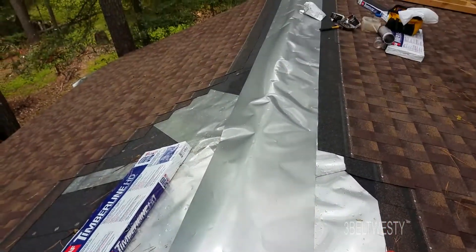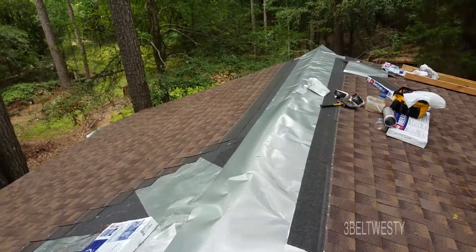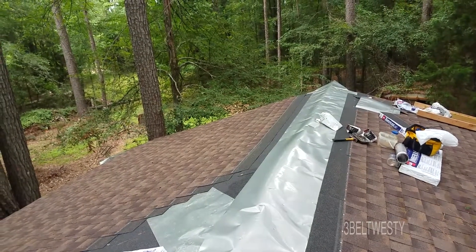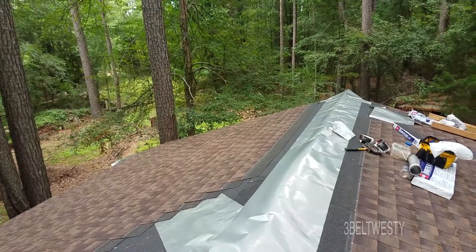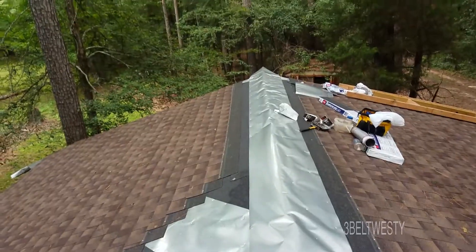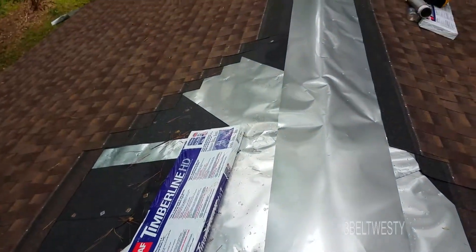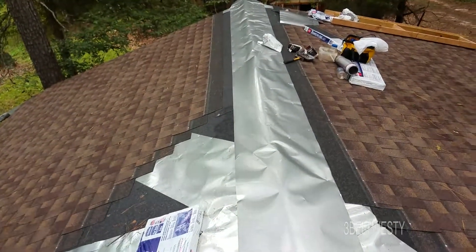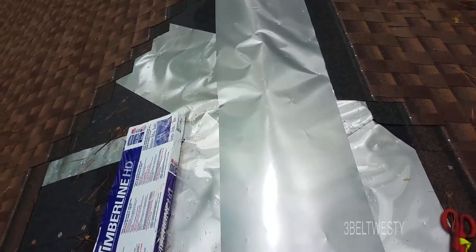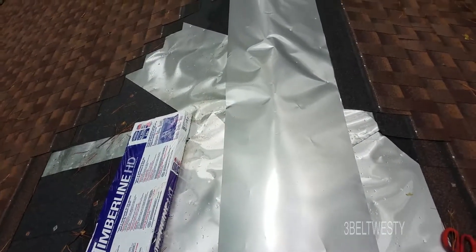The only reason I've got a bunch of nails in there is just so it holds down — it's hard to keep flat. If you over-constrain it you just add more buckles, so sometimes it's better to not nail it in too many places. When I nail over that with the Timberline HDs I'm using aluminum siding nails, just so I don't have a corrosion problem, and then this all gets bonded together.